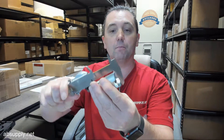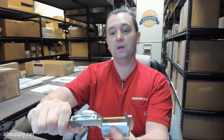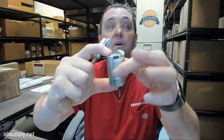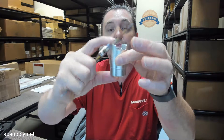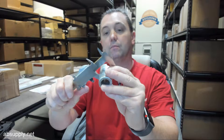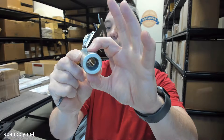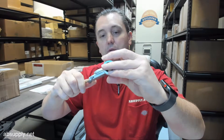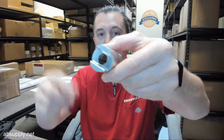Now the overall — not that that's necessarily important, but for the sake of taking the dimension — 2.087 diameter, 1.253. The ID down here, not that it's super critical, 0.523.